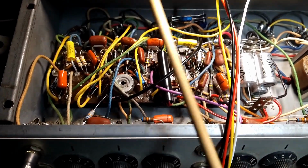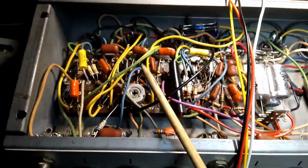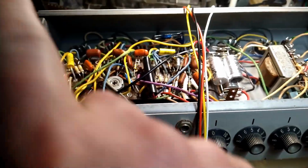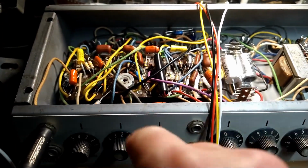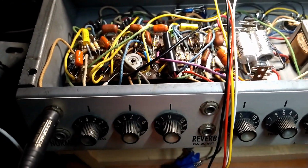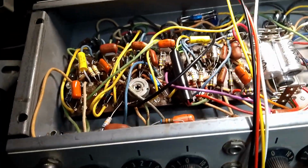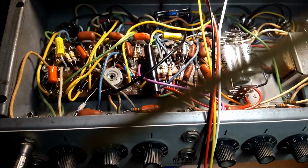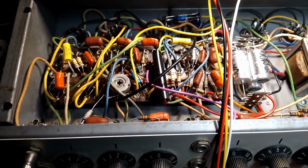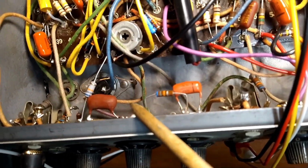So I'm thinking we might want to play around with a Fender-style tone stack, because that has a nice scooped sound to it. Cut out a little bit of that mid-range. Or possibly a Vox. I was playing around with the tone stack calculator on the internet. I'll leave a link in the description if you want to play with that. But the Vox may do the trick we want to do with this as well. And those would be the easiest to implement.